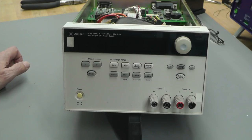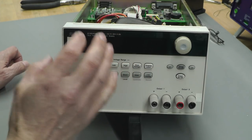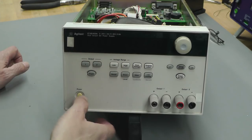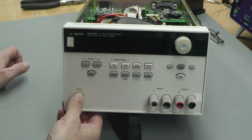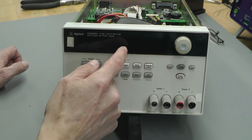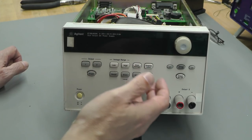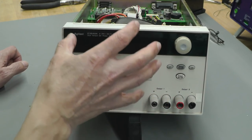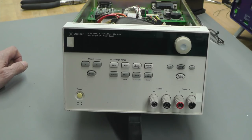Exactly the same symptoms. You would be forgiven for thinking the microprocessor is responsible for resetting the display, as you saw there, but it's not actually the case. There is a microprocessor on the display circuit board itself, which is responsible for turning all segments on, then off again. But thereafter, there's no communication between the display and the main digital board. Which is obviously why there's no display. Whether we've got something along similar lines is yet to be seen, but it looks like at the moment we've at least got a digital board problem.